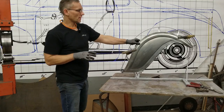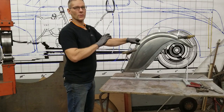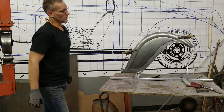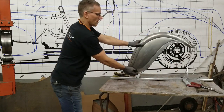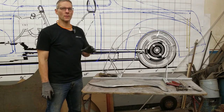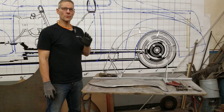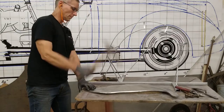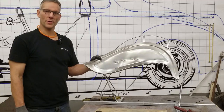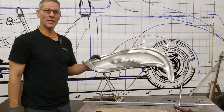I hope this little video gave you a little bit more insight in terms of bead rolling. Beads make a world of difference — instead of having a flat, clean, straight panel, give it some design and it looks a lot better. You can do an interior door panel for your car, hot rod, whatever — we've done it before and it looks really trick. Now before this falls down, I better set it down on the table. Alright guys, so the next video we're going to get into shrinking techniques for sheet metal — everything from kick shrinking to tuck shrinking, which is what we're going to use to bring this top edge down into contact with this rod on the wire frame. We'll also talk about what happens to metal during minor collision damage. It'll look like nothing ever happened — I hope. Thanks so much for watching guys, and take care.